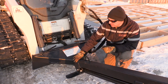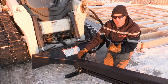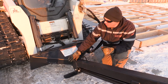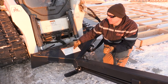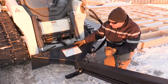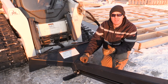The construction of this is very specific to its task, because it has to withstand the loads when it's lifting, and these loads are concentrated along this tube. What we have here is a full piece of quarter-inch plate steel, solid welded to the mounting plate, and we have wedge bar reinforcements here so that there's no danger of anything cracking or breaking off. We also have a lift eye here if you want to carry this around or put it on a truck — this is right over the center of gravity of the Teleboom.